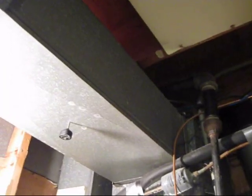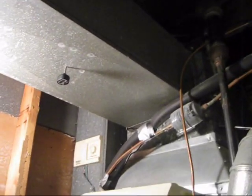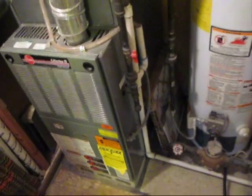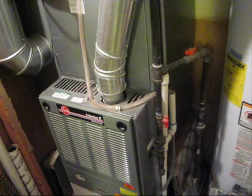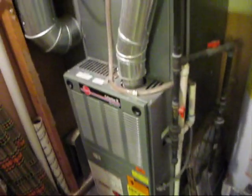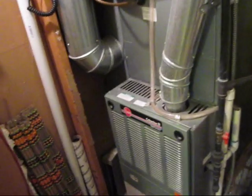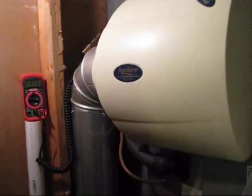It is warming up, this one's pretty hot. That supply has closed off and it doesn't seem to be causing a problem — I think there's still plenty of return air. I did crack it just a little bit on that end, which won't make much difference. It's warming up in the basement pretty quick too; this basement's decently insulated. The furnace fan speed is medium high, which I want to bump down to medium low. And I want to move the air conditioning for the summer onto medium high instead of high, because it doesn't remove enough humidity and the furnace just seems to be pumping out warm air way too fast — heating up faster than I would like.